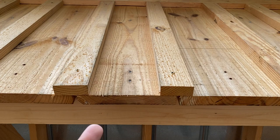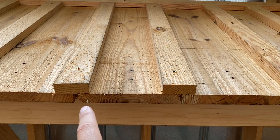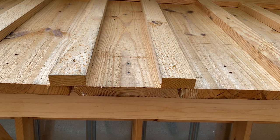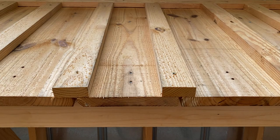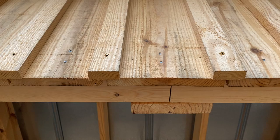That further helps the stability of your siding. If you had flipped this so that the rings were smiling inward, the board is going to want to cup outward. Remember, we don't have nails on the edges because we want that to float and move. If it tries to cup outward there's nothing to prevent it except your battens. It's going to put uneven pressure on the battens — if this board wanted to cup but the next one didn't, it's going to twist the battens, and that's when things start to get unstable and look really bad. So just remember: have that grain smiling outwards, and that will further enhance the stability of your siding.